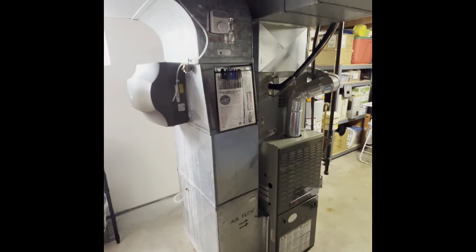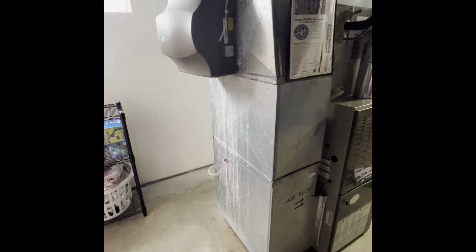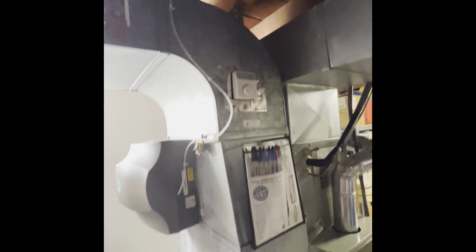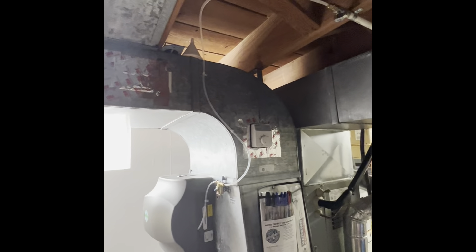We're here in the basement of the Seriati residence looking at a possible full system replacement. We've got a Trane standard efficiency furnace using a four-inch flue stack, got a one-inch filter cabinet, a decent sizing on a return drop — I think it's 12 by 24. We do have a transition that needs to be made to equalize our airflow. It's 8 by 22 coming down here; it might be easiest just to rehang this piece of duct, get it to a 25, and come across as opposed to redoing a transition.